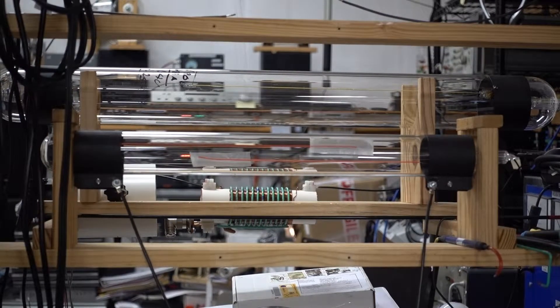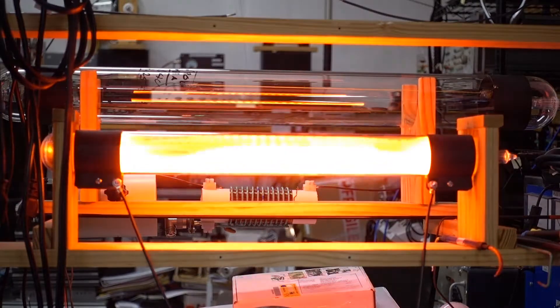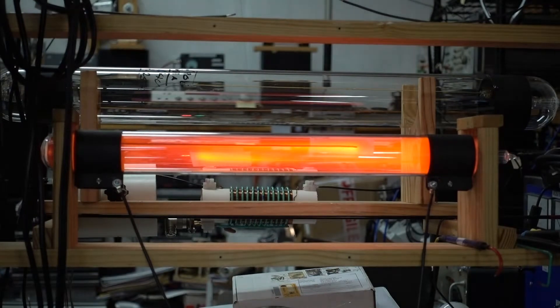The tube has been resting for a while, so it's cooled down. Now we're going to power it back up, and we may see some interesting effects in the beam. This is typical of a new tube when it's first turned on. First it came on in high brightness. Now you can see the glow along the side wires — the tube is not fully ionized. It needs to be operated at a higher voltage, so we're going to raise the voltage.